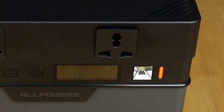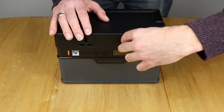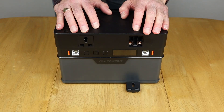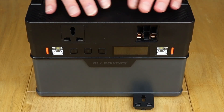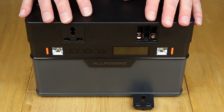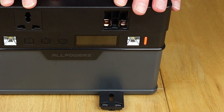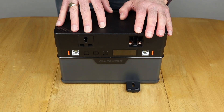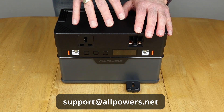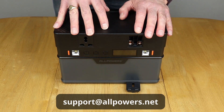As you can see, I popped a socket. I was just using it in the normal way — I pulled the plug out, it started to become loose, used it again a second time, and the faceplate effectively just detached from the back box. In that case it's a warranty claim. I contacted the manufacturer and seller to cover all bases, and they did have a fix — fairly easy, but it involves opening the box, so you must contact them before doing anything like that. I've also heard from others with the 372 version who experienced the same issue. It is a design issue; the manufacturers are aware of it and hopefully will come out with a revision in the future. This won't affect everybody, but if you're a bit more heavy-handed, like myself, you might run into it.